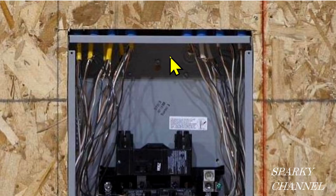This one needs to have a quarter inch of sheathing and it doesn't. This one does not have any sheathing and I don't think it even has a fitting, so this is wrong in multiple ways. I'd like to see all of these be the same — if you're going with an inch and a quarter, let's make them all an inch and a quarter, nice and neat coming down.